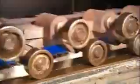Next, nozzles deposit measured amounts of batter on a baking plate that looks like a moving waffle iron. Top plates flip down, and the baking plates roll through a gas-heated oven for a quick bake. The top plates lift up, revealing the cooked waffle patties. Automated arms help transfer the patties to rolling tools. The tools grab the patties and twist them into cones.